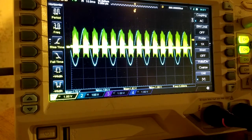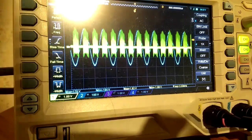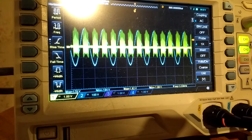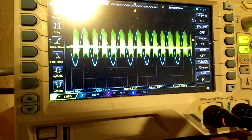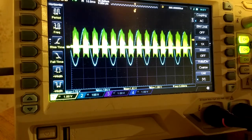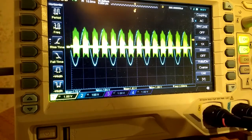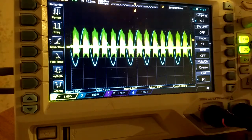But I'm actually getting almost a volt and a half, two volts of noise steady across — so it actually was creating its own noise from the inverter I was using. After chasing my tail for a long time I figured out that this was happening, and maybe this inverter would work great if you weren't trying to read the signal with an oscilloscope that's powering it.